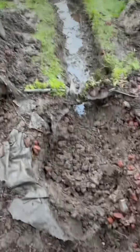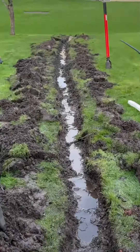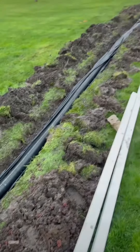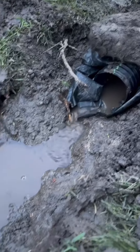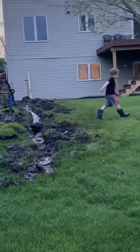Let's get a full view of this trench. I started at the house and went all the way to the edge of the hill. I know it's crooked — tree roots, rocks, you know the drill. I simply went around the rocks instead of trying to break them up. The pipe is perforated — you can see the holes there — that's how the moisture gets inside the pipe to start flowing. We can't just throw that in the dirt or it'll get clogged up, so we put a giant sock around it to help filter the water before it gets into the pipe. And just a few minutes in, it already started flowing.